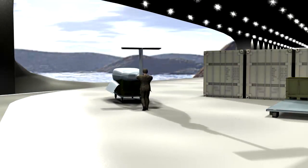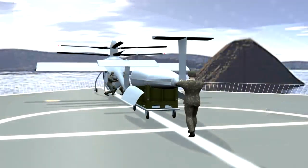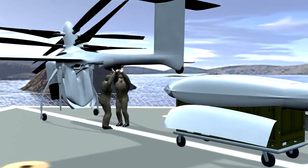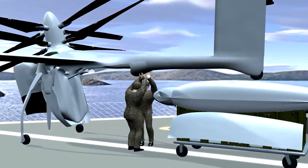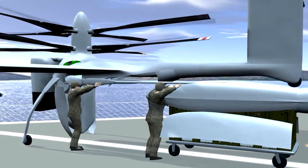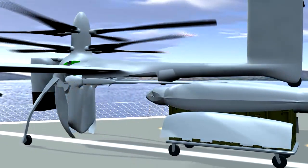Notice that the aircraft's tail wheel and wingtips prohibit aircraft tip over. The front wheels are also rather far forward, but can be pulled afterward as shown to lighten the load on the tail wheel so that ground crew can lift it onto the cargo pod. The suspension struts are then connected by cables to the cargo pod.